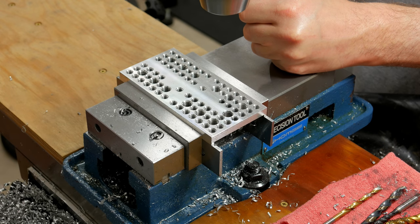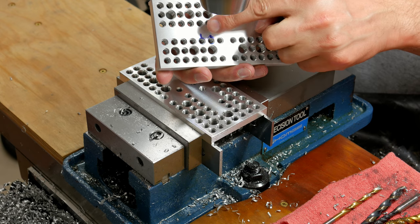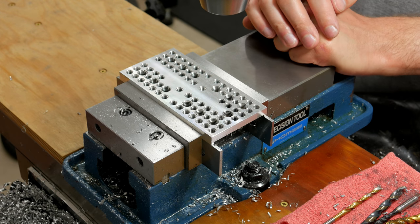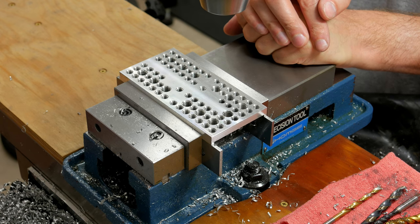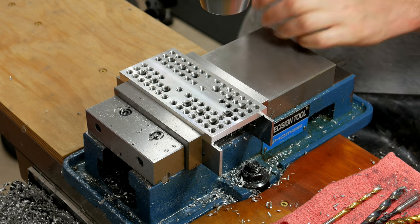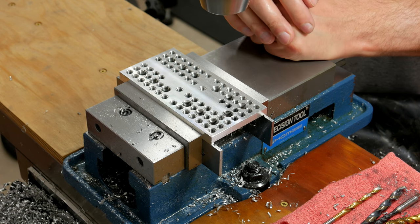It's been about a week since I filmed the last clip, and the delay is because two things happened. While machining the original plate, I wasn't watching the print closely enough and I put two holes in and tapped them that weren't supposed to be there, so that part became scrap. Then once I made this new plate and started drilling and tapping it, I noticed the quarter-20 tap I was using was starting to get dull and that was the last one I had. So I ordered a new one because I really didn't want to break a tap off in a part and scrap it again. As you can see, I've got quite a few holes — I think 9 or 10 to go. Let me show you the process I use to drill and tap all of these holes.